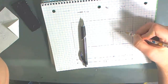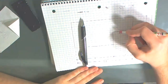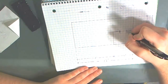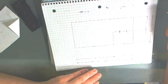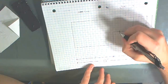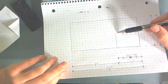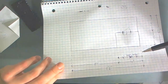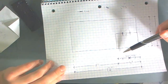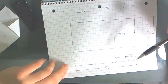So we go roughly half an inch from each side and that's where the door edges are. Take note of that — put lines on either side of the door to show that there's a door there. It doesn't need to be exact on this drawing, but we know it's centered in the wall. You could even write 'on center.' I noted it's 2 inches to the center on either side, and that the door is centered. When we're framing it, we'll just make the door 1 and 3 quarters inches wide. I'm not putting the measurements from the wall edge to the door edge because that would be a weird fraction.